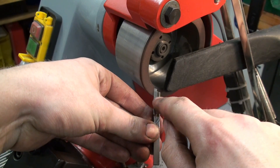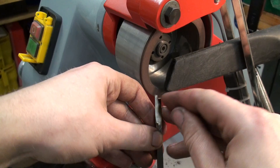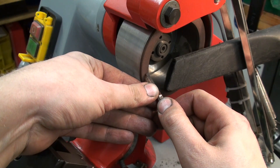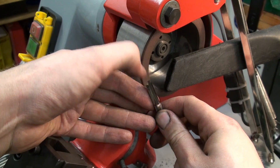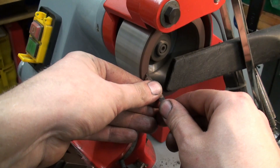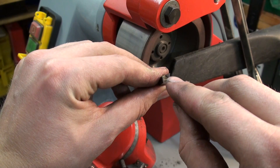I ground the top rake and the side rake both to 7 degrees. I just need to grind the front relief, and I'm going to do this by free hand — just holding it up approximately in position to the grinding wheel and going for it until the front face cleans up all around. And that's all it takes.